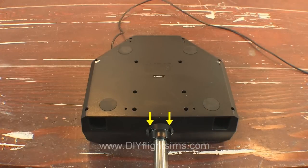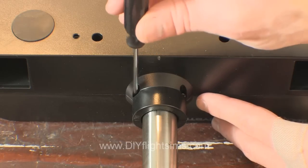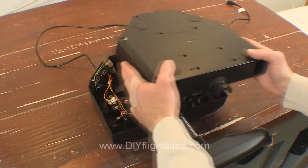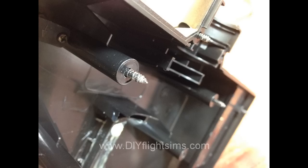There are also two tiny screws at the base of the control shaft. Remove these and be careful not to lose them. Remove the bottom of the control housing. Most of the screws will probably remain in the housing, and that's fine — that will save you the trouble of replacing them later.